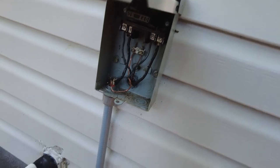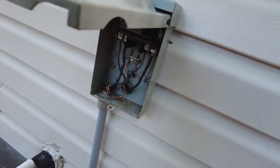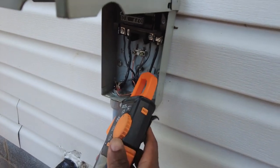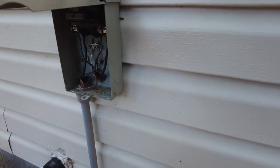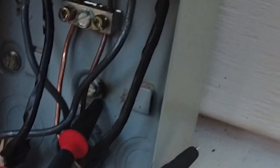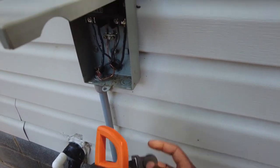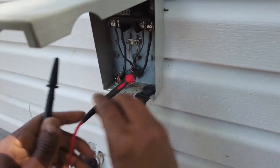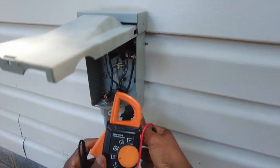So we've got our wiring coming in going to the load side, coming out of the sub-panel on the line side. One thing I do see that's kind of peculiar — it looks like it might have arced something there. I'm going to check voltage across that screw and ground and see if we've got a load on that screw.